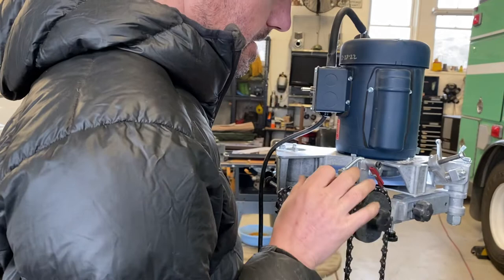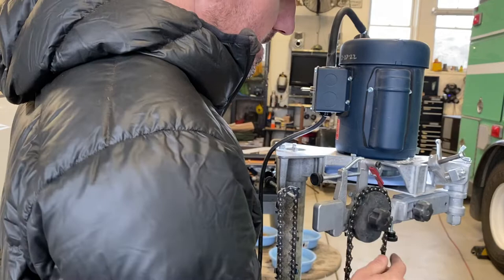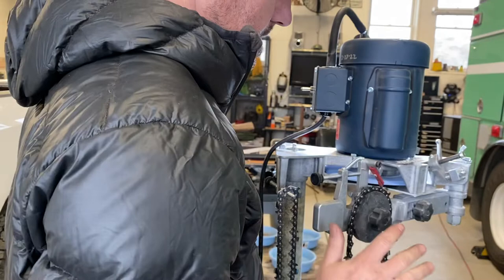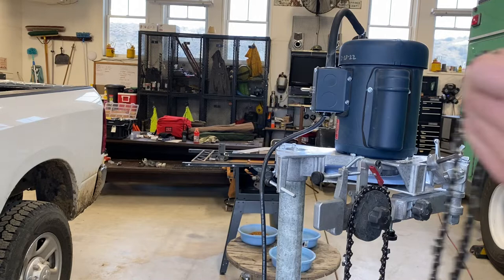Because when you flip it over, even if you're just a little bit off and making slight adjustments to line it up, your angles are gonna be different on one side or the other. If you raise it or adjust it, it's gonna take more wood or less, or be more aggressive. You want it the same on both sides. I got lucky — mine was perfect right out of the box. I just did this one earlier today.